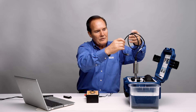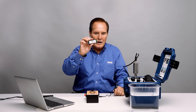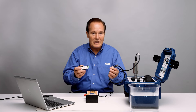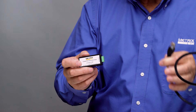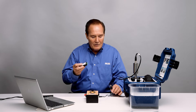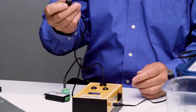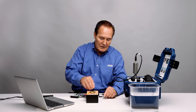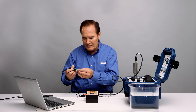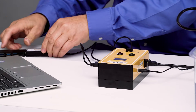In order to configure it, you have to connect the 8-wire conductors to a dongle that uses 4 of those wires. So we use 4 of the wires from the 8-wire bundle that comes from the device — whether you use the MIL-style cable or the flying leads, you'll have 8 wires. For the purpose of this demonstration, I have another wire that I'm going to connect to it. This just completes the connection from the compact switch to the dongle so I can connect it to the computer. So I'm plugging it into the dongle, now I'm plugging it into my computer, and then I'll connect to it.